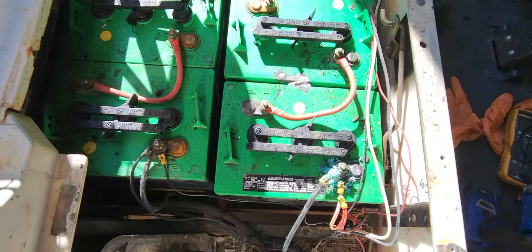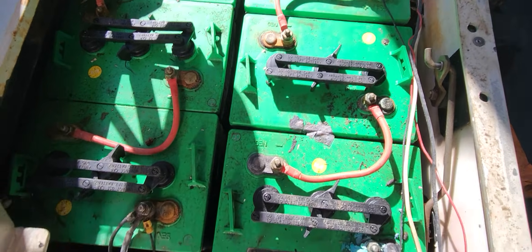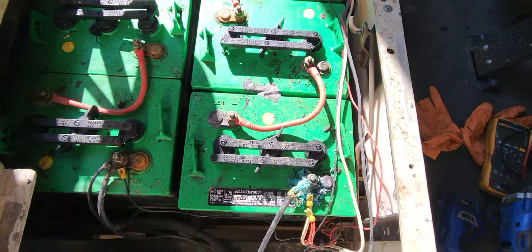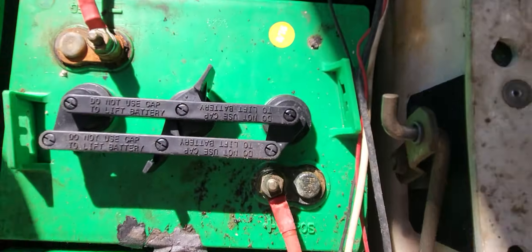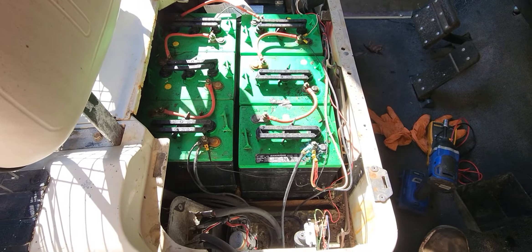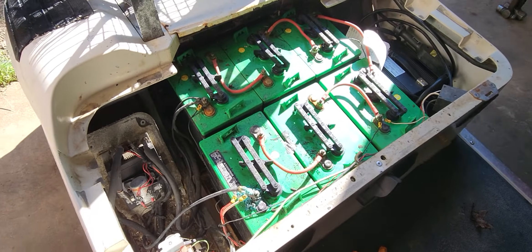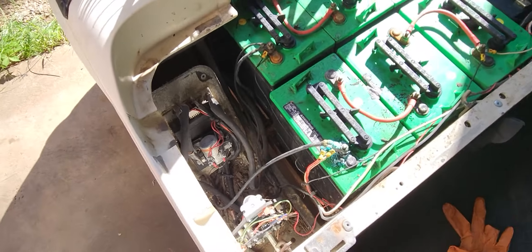But that's not all we're going to do — there's lots of corrosion. We're going to replace these wires and may replace the batteries because they are from 2016 and pretty much at the end of their life cycle. You might ask how I know they're 2016 — if you see this yellow sticker it says 8/16. It's 2022, so that's six years old. That's the lifespan of these batteries; you're usually not going to get much more than six years. The fact that they lasted six years means they've been pretty decent batteries, but he's probably going to want new batteries.